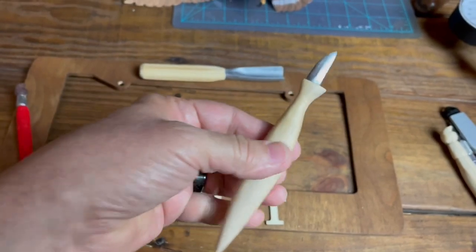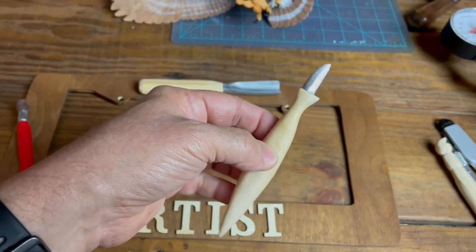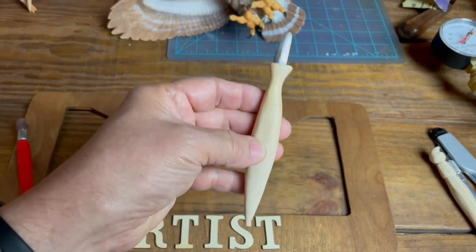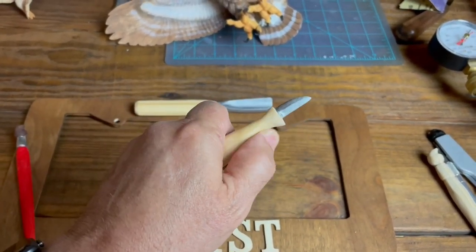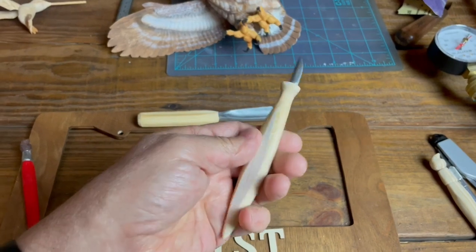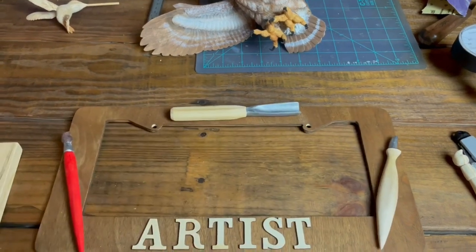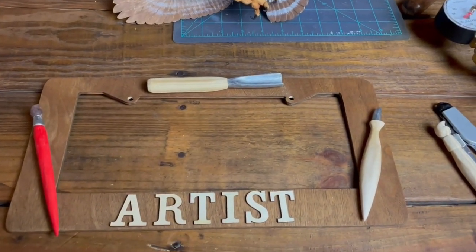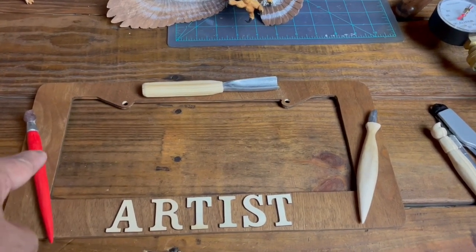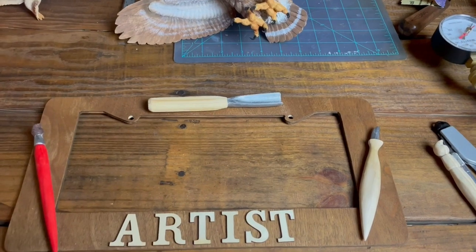For the knife, I simply practically traced this off of an actual knife, especially the blade itself. The handle I improvised a little bit. I brought it in a little more here and a little more here for style and design, but flattened the back to give it a better contact surface. I will use an all-purpose outdoor glue, and I will use brad from a nail gun, two brads in each one of these to give it a mechanical hold as well.